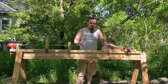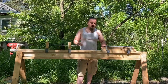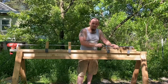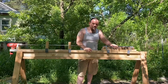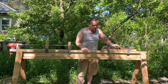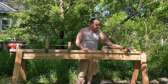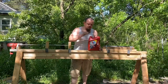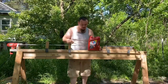I ordered some shotgun barrel hones to polish this bore in preparation for lead lapping. From the test barrels, I tried to just pour a lead lap and work out the gouges that way, but the lead was pouring into those gouges and locking the lap in place, making it impossible to lead lap. So we're going to use the reamer and then the barrel hone to bright-polish this bore.